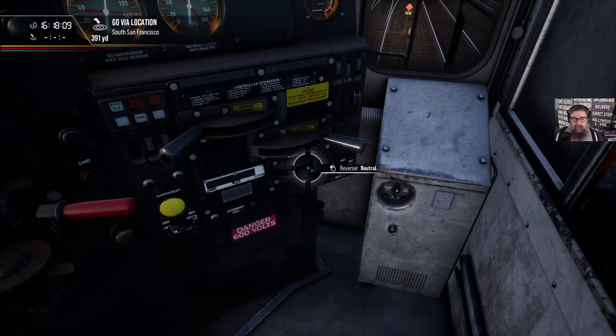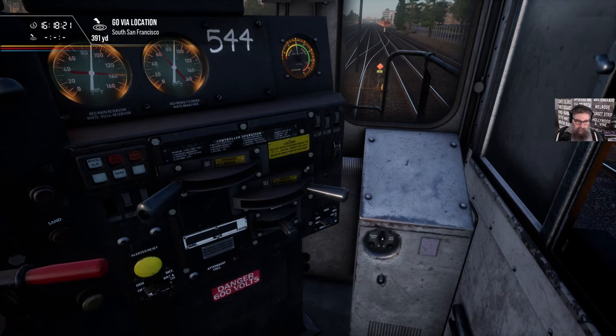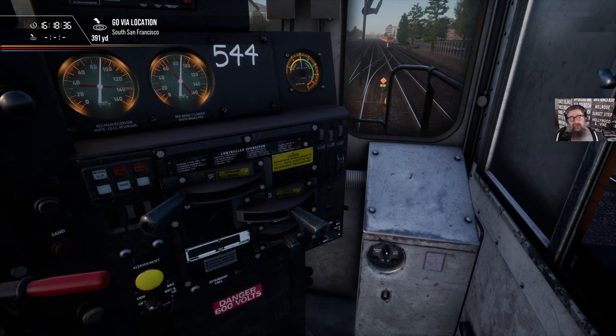We're still in neutral here. We've released the train brake but maintained our independent brake. What we want to do now is make sure the brakes actually work. To do that I also want to make sure the compressor is working properly. I deliberately don't have the generator field on so we won't go anywhere. We'll speed the locomotive up through the throttle notches — you can hear it speeding up — and then step back down again. Doing that, we're making sure that we have control of the diesel.